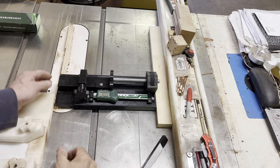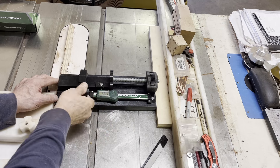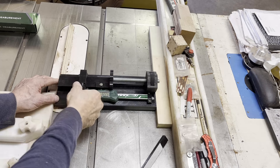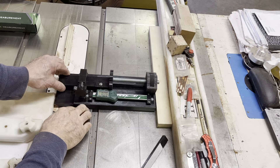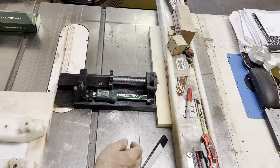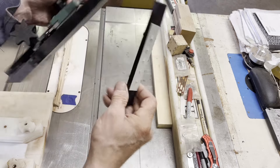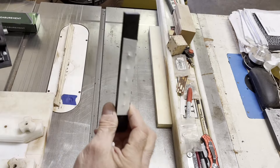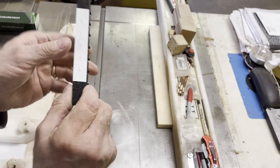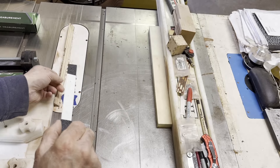New table saw stop — the change here is the stopping magnet mechanism. You have this knob that squeezes your stop, and it's solid as a rock. When you get this from me, you'll get this slot here. Take the tape off and take the screws out first. Put it on the slot you want, keeping these little knobs away from the blade.